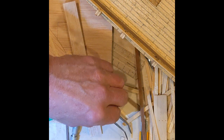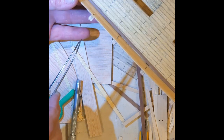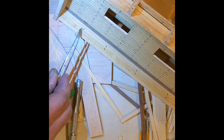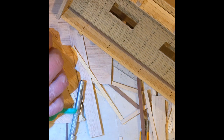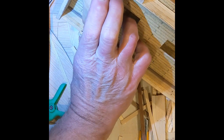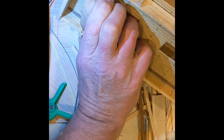Tweezers. Wearing these magnifying glasses, they're great, but when you try to see anything that's just out of your range from the glasses, it's rough. All right, so let's get that nail in there. I don't think I drilled that deep enough. The problem is, if you don't get it deep enough, it's a fine line. Now it's in there pretty good. All right, back to the little nail pusher. Kind of support the back a little, and in it goes, just like that.